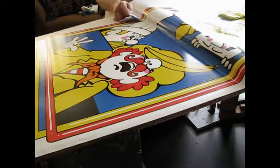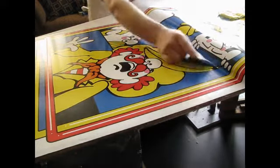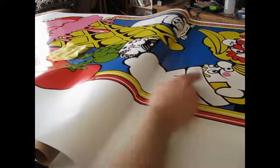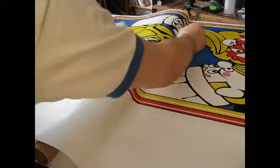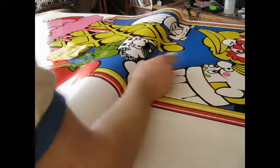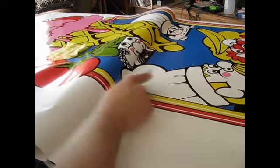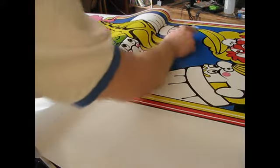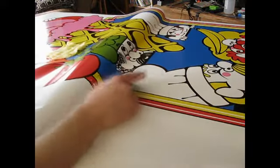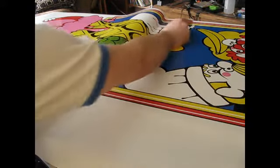On a side note, I am often asked, how was the side art aligned and installed at the factory? The answer is, they didn't. Plain white vinyl was laminated to sheets of particle board that were clear coated in polyurethane. This gave the vinyl better stick and a nice smooth and even surface. Then, this piece was screen printed one color at a time. Once the printing was finished, the piece was cut on a router to the cabinet's shape, and then the cabinet was assembled. So they never had to align and install side art like this on thousands of cabinets.